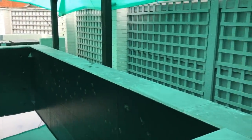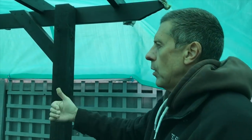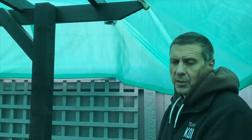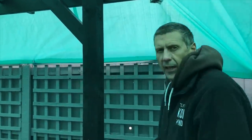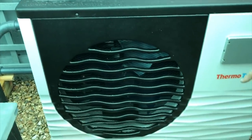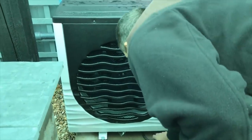The original intention was to actually put it down by the edge of the filter house, down that dead corner there, facing that way. It just about fits and we could give the required distance at the front and back, but the sides were just a bit tight to be honest - there would have been no clearance at the sides at all. Particularly with the condensers on that side - the book says you need 700mm. So I've put it here on a concrete base - a concrete slab that's actually concreted in and levelled.